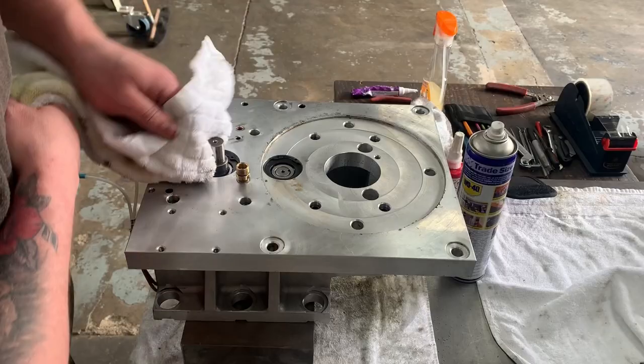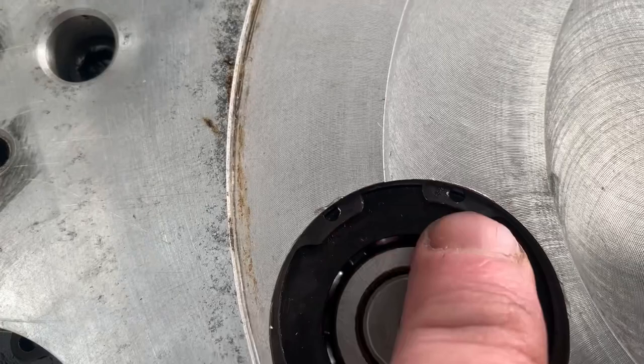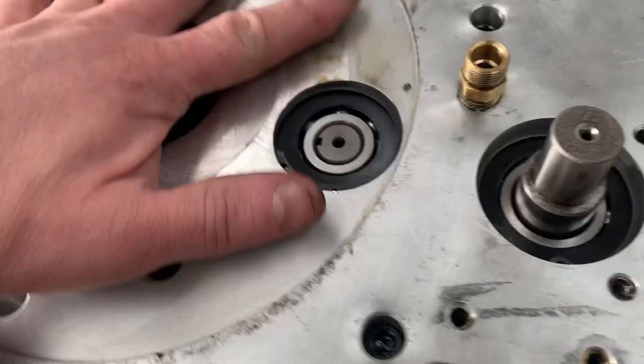Go out again to show you. So there's our circlips. You can tell when they're seated because the actual hole for the circlip pliers sits right in. That one's got a different type of ear, but the same effect. And you can see that that's actually into that back recess, because that's what you have to be careful of, that it isn't seated and it can come out. Now this one sits the motor over the top, so it can't really go anywhere.